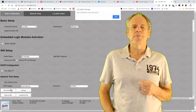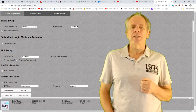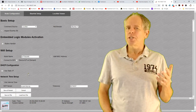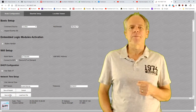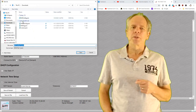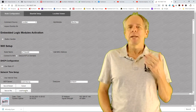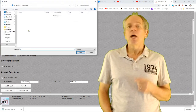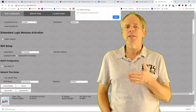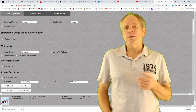At the end of the page you have four buttons. Click 'Save and Restart' to apply your changes — the web page will write the data to the IoT stick and reboot it with the new options. Click 'Cancel' to disregard all changes and restore all data fields to the current settings. 'Save to File' lets you download the current stick settings to a file on your computer. Should your stick ever lose its configuration, you can use the 'Load from File' button to reload the saved configuration. Note that 'Save to File' downloads the entire configuration, including hat and embedded module settings.